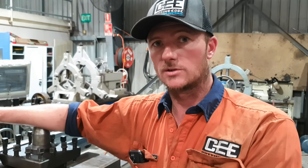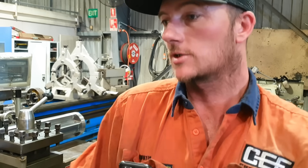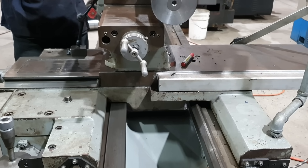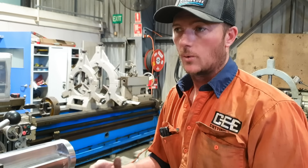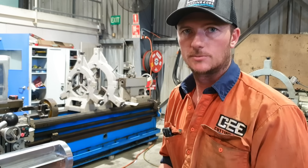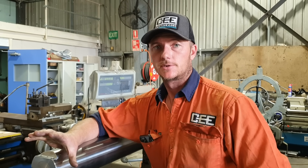The bar wasn't designed to hog out material — it's going to be perfect for the job we need to do with it. There will be other modifications to the tool post and carriage on this machine to support this bar correctly, such as a big clamp across the back of the bar or a bracket off either side picking up off the carriage. Really happy with what we achieved with the boring bar today. There is a lot more testing to do — I'll dig around in the yard for some 1045, 4140 and put the bar through its paces with different inserts, tools, coolant and oil. Keep an eye out — we've got an upcoming job where we will be using this bar.